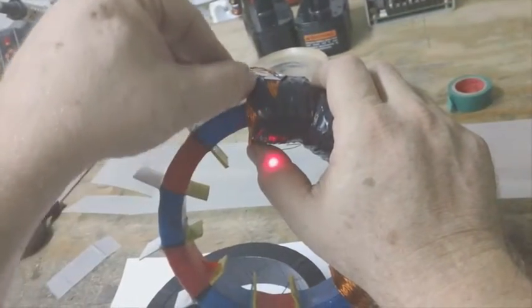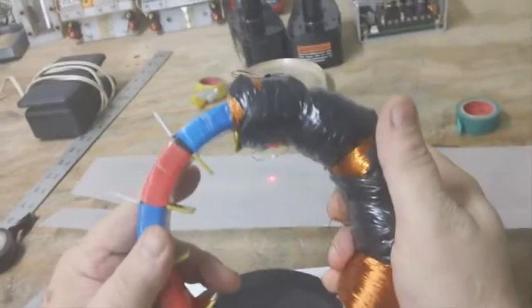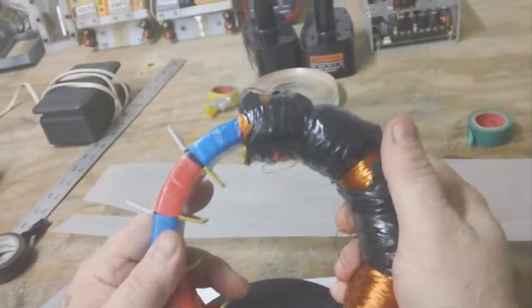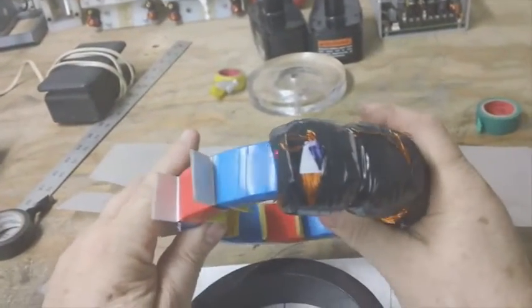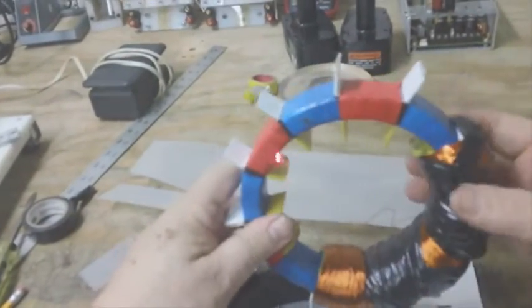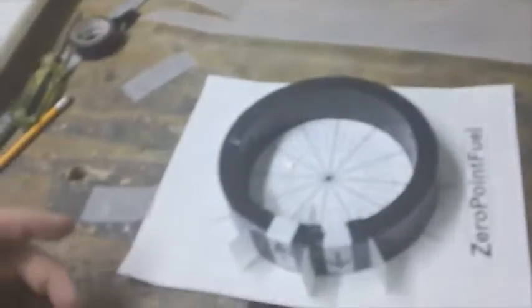This line here is basically off center, and it's really my fault — I was running the thing too fast. I started winding it by hand thinking I could keep it in line easier, but that got so tedious I broke down and used a winder. Now I've got to go slower and block it off on both sides of the coil while unwinding, to make sure the coil stays within the boundaries of this space. If it's extending beyond that, it throws off the synchronized movement of the field flipping.